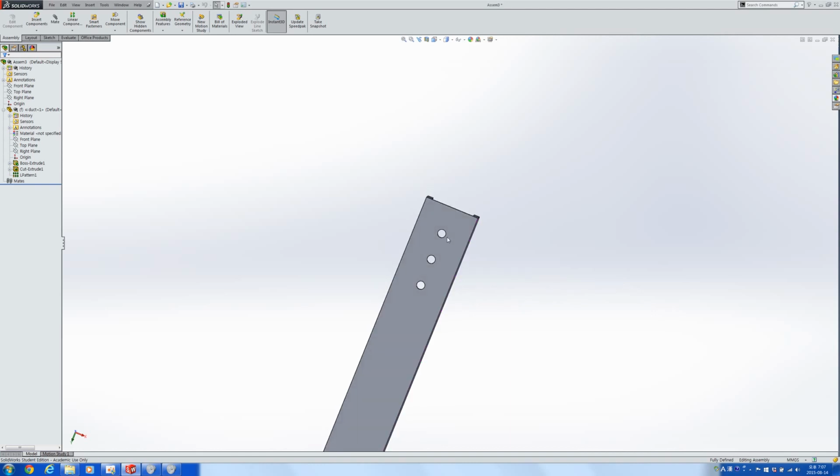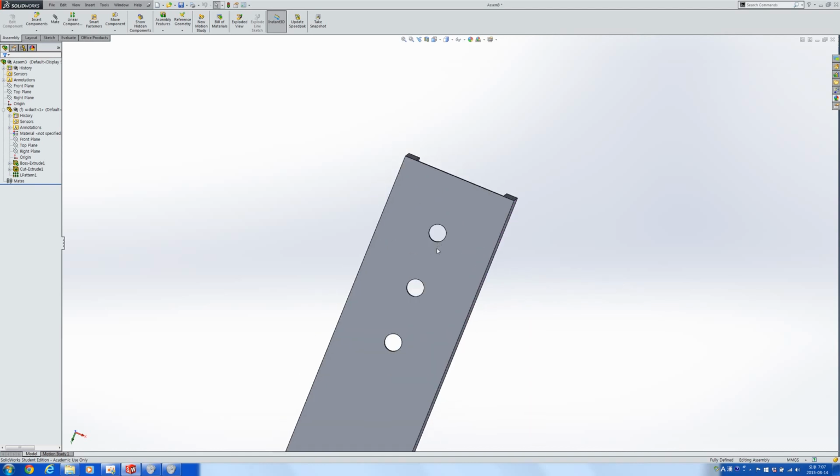In this case, I do not want to use bolts that are too thick, so I would like to use an M3 bolt, which is a bolt with a 3mm diameter. But then one single bolt is too weak, so I ended up thinking that I may have to make a gearbox, a pulley box for all the pulleys and the supports to be in.